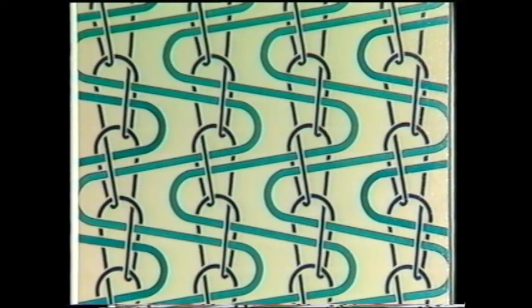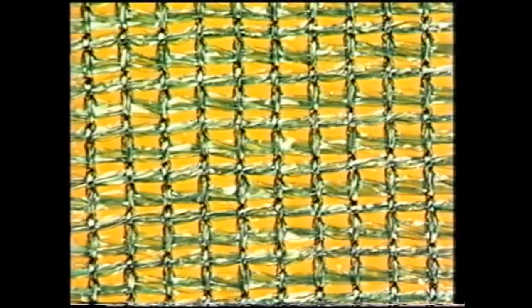As has just been seen in the diagram, 2 fabric sheets are manufactured here on the 2 compound needle bars using the respective ground bars. For this purpose, the pillar weft inlay shown in this diagram has proved successful for decades. The density and carrying capacity of the packaging sack fabric depends on the chosen gauge and can be additionally influenced by the width of the tape yarn and stitch density.